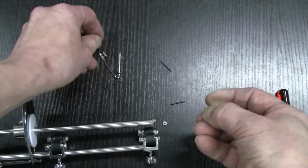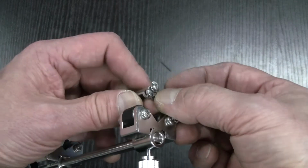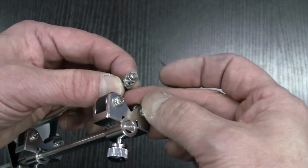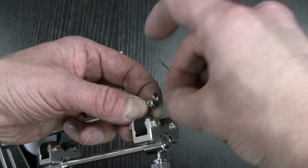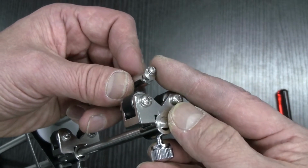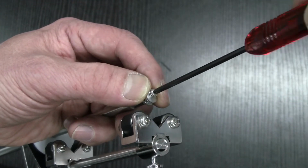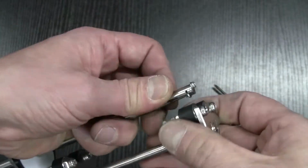9. To replace the cutting wheel, work over a table so no small parts are lost. Loosen the retaining cap screw and twist the retaining cap to reveal the cutting wheel pin. 10. Remove the pin and the wheel will come out easily. Replace the old wheel with a new wheel, gently wiggling the pin back in place. 11. Rotate the retaining cap back in its place and tighten the retaining screw.